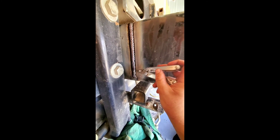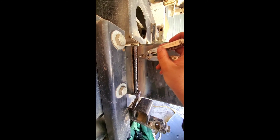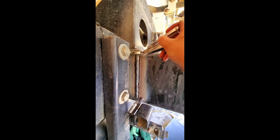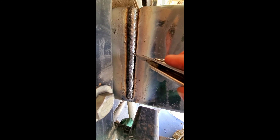Putting on the cap passes. I had a little bit of porosity I had to grind out. I'm not looking too bad, I need to hold my toes a little bit longer. It's been a while since I've ran dual shield flux core.